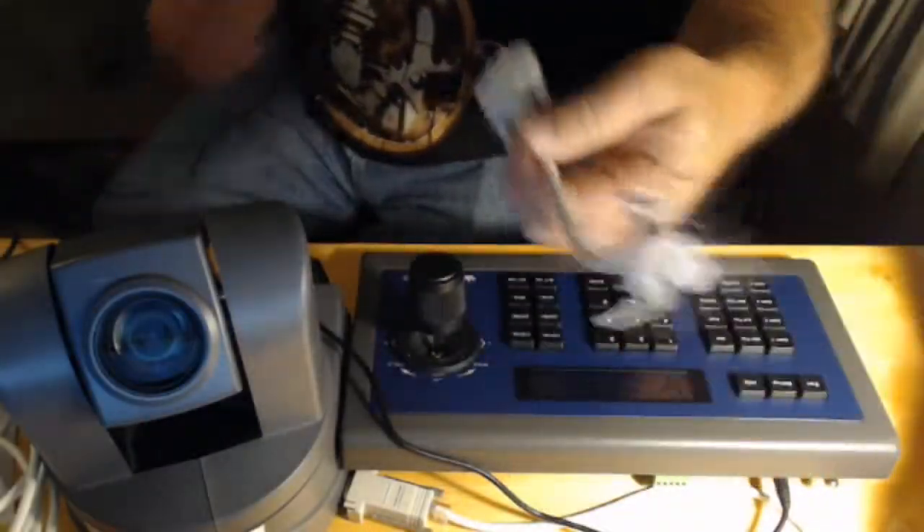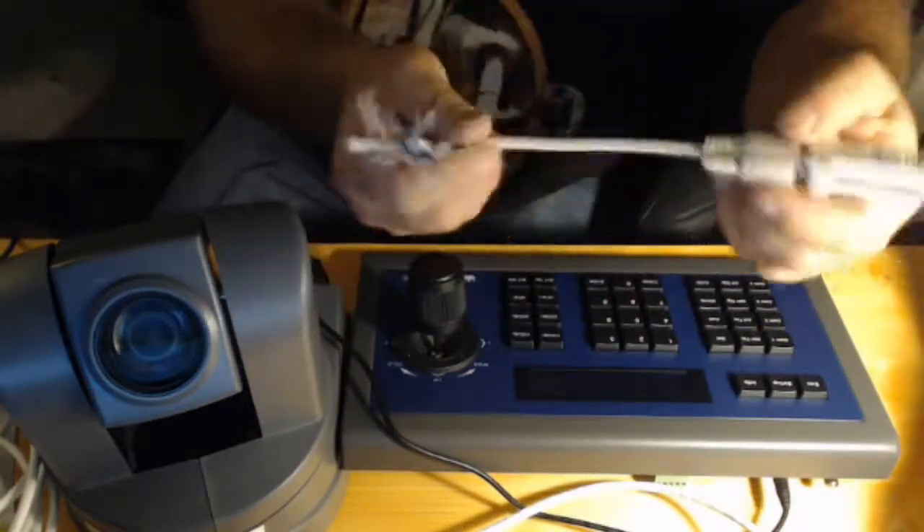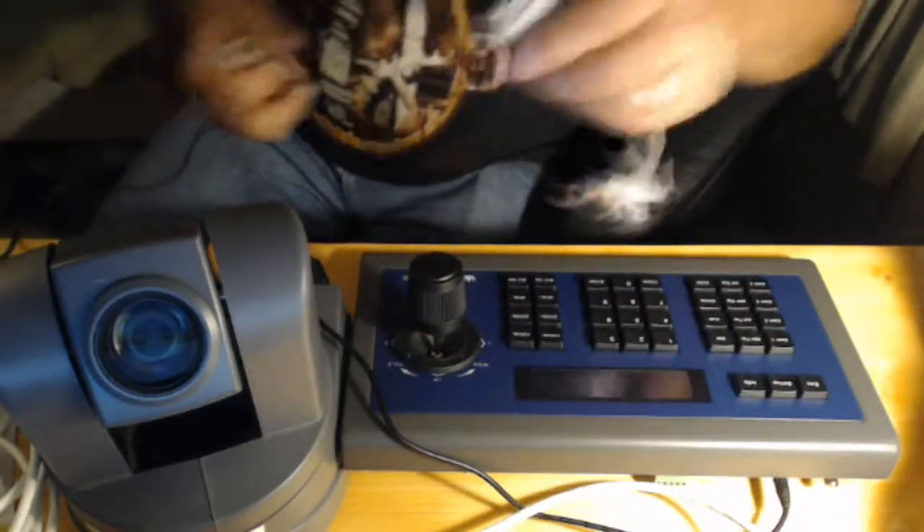So what do I do? I remembered that the manuals for both devices showed the pinouts for the controller and the camera. What I found out was that the pinouts don't match. So I took an old serial cable, basically butchered it, tore it apart, and used the colors to match them up to the adapter. Then I took an ohm meter — any continuity tester will work — and I matched the different colors to figure out which pins corresponded to which end. I was only concerned with pins 2, 3, and 5.